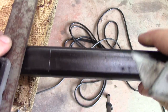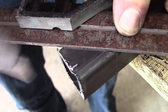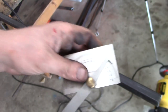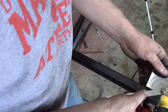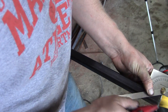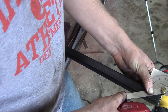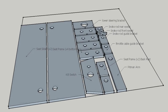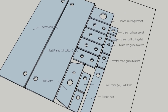The first step is marking steel. I'm using a square here to get a 90 degree cut as well as a 45 degree cut, and I'm using a razor blade to make that line really show up on the steel. This is a protractor, so if you want an angle other than 90 or 45, it's great to have. It's very important that you cut all your steel first and cut all your plate first so you can be very efficient in your build.